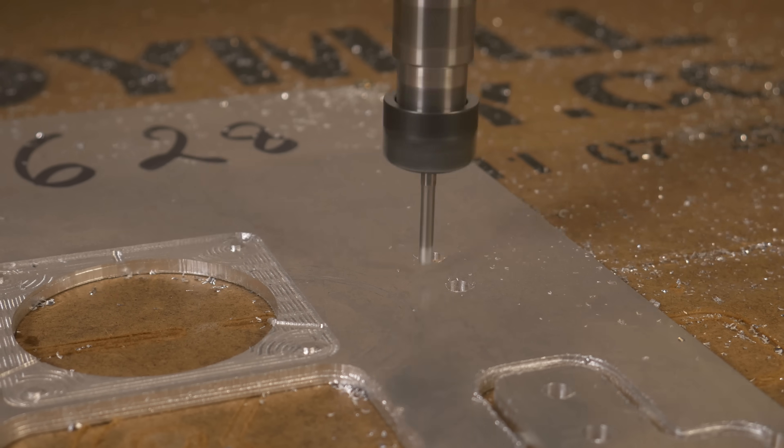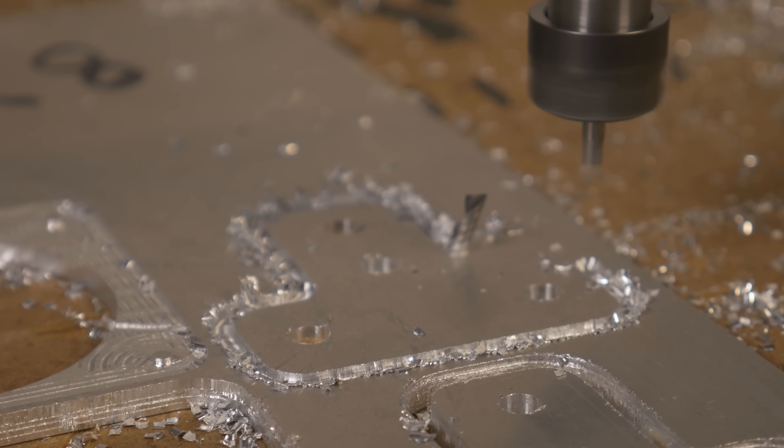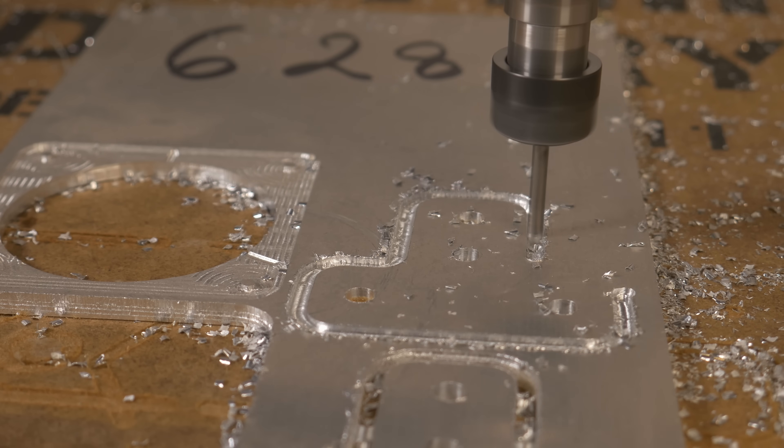The first milling on the IndieMule was successful but wasn't as great as I would like, so I changed some settings in Fusion 360 and tried again. And I broke the milling bit, so I tried again. And I broke another milling bit. Then a piece of aluminum stuck to the end of the milling bit, making it useless — so we can say I broke a third milling bit. What was the problem? I actually thought I was milling too fast, but it turns out I was milling too slowly. In aluminum it is just as bad when you mill too slow as when you mill too fast, and it's hard to distinguish the two. The milling bit itself was also very inexpensive so the quality was probably not the best, so I tried something different — something bigger.